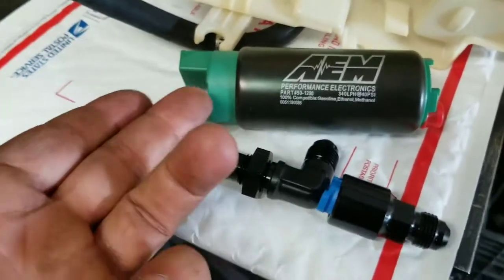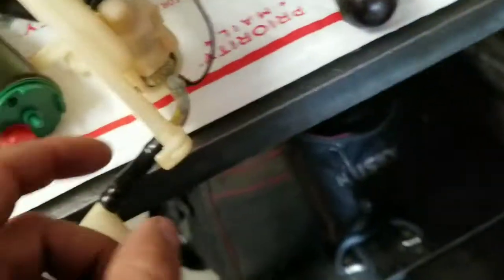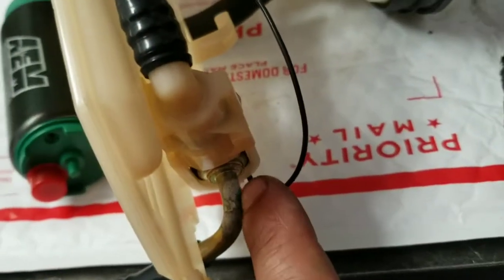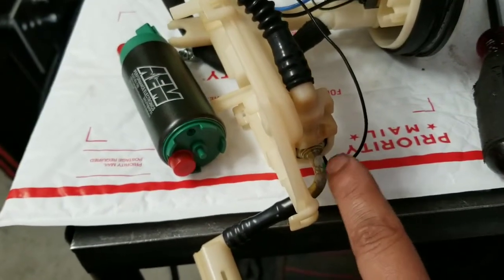So I have the whole fuel pump housing disassembled. This is a new fuel pump you want to put in. These are basically the only two pieces you need to make this into a return system, plus we have to do one more other thing. You need to disable the stock fuel pressure regulator. You must disable this.